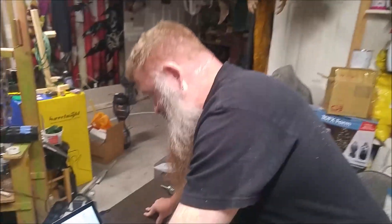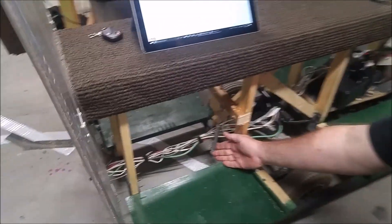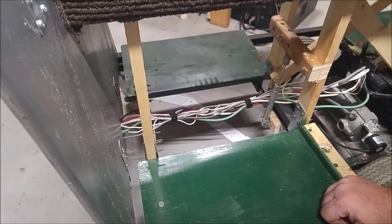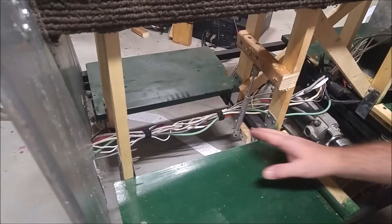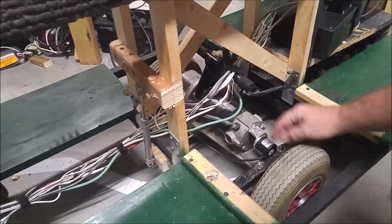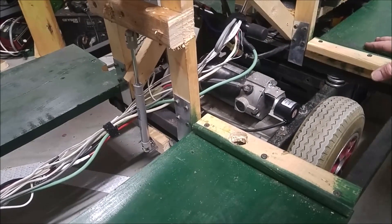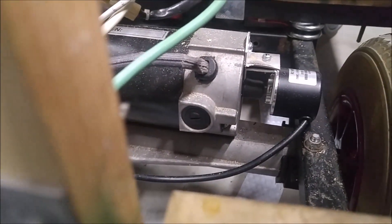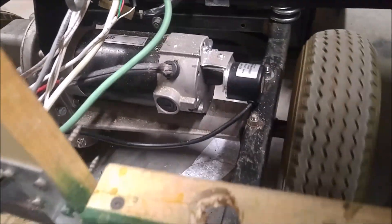I want to point out the lack of a trailing encoder wheel. I made some math mistakes and was blaming it on the fact the wheel was trailing — I thought I was not getting a reliable connection. So I've moved the encoder to here. I built a bracket and a coupler on the shaft of the motor, and I've added a bit of tape just so you could see the coupler moving. I'm moving the cart back and forth to demonstrate.